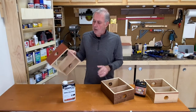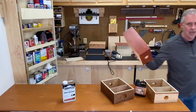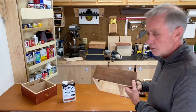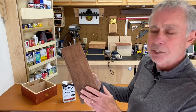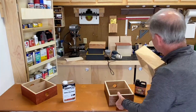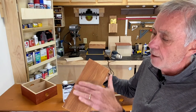So let's talk about our results. I wound up putting three coats of the polyurethane on this cajon, and it wound up with a pretty nice sort of satin gloss finish. I used a glossy polyurethane, but if I wanted it to be more glossy, I'd have to put a few more coats on there. The Solar Res finish on this particular cajon didn't come out quite as well as I would have liked — there's a bit of shine in there but it's just not consistent. It does feel extremely smooth, so it's a little bit more finicky to work with. Here's another example of the Solar Res where I was able to get it smoothed down to a glass-like finish, and it looks very consistent across the whole finish. I'm really, really happy with the result on that one.